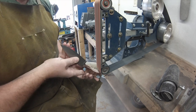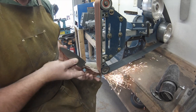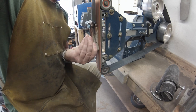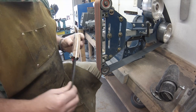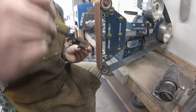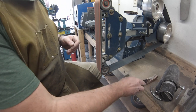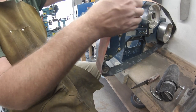I can get inside this portion with that two-inch wheel. See the sparks — it's obviously still hardened. I hit the flats and get those pins knocked down if they're a little oversized. The micarta pins are nice because they grind away at the same speed as the wood. If you've got metal pins, you can overheat them, which will soften the epoxy and they can move — you can also burn out the epoxy. So don't overheat metal pins. We're going to change the belt to a higher grit to polish that metal up.